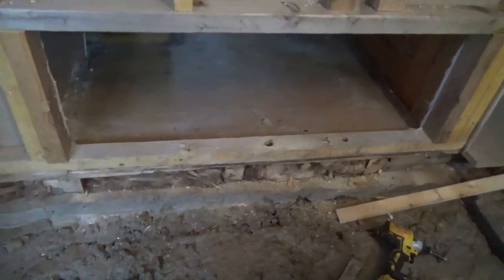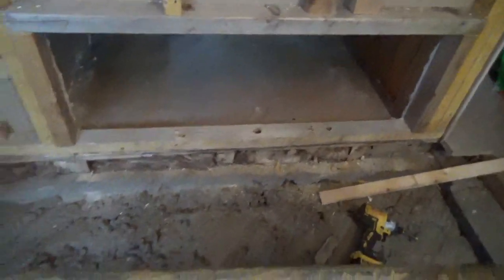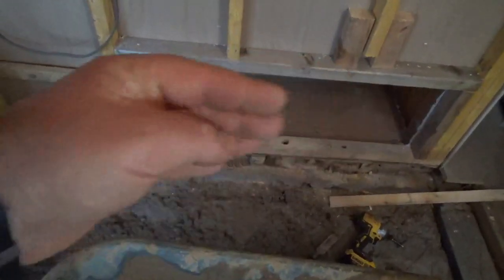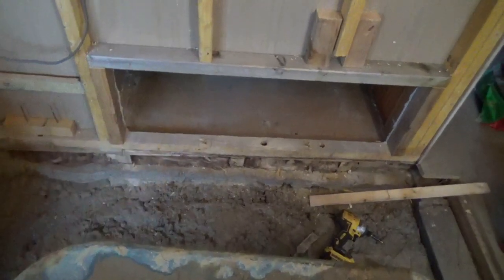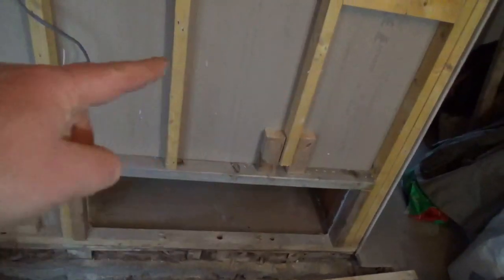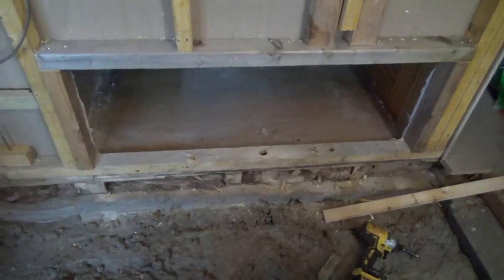There's the cutout through to the bathroom. So the mass wall will be built against the back of that with a slight gap, and then insulated around, and that'll have a nice wooden frame on the other side of that wall. We'll be able to hang towels and things higher up on that wall, and we'll have a nice warm bathroom.